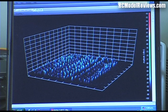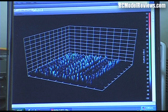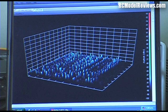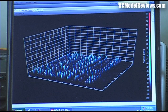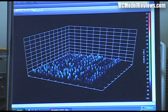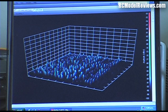I've switched to the three-dimensional view so we can see what happens over time. At the moment the receiver is turned off and the transmitter is further away, which is why the peaks are much smaller. Now I'm going to turn on the receiver - if it's broadcasting anything back in the way of telemetry we should see a change to this pattern. The receiver is now on. I actually don't see any marked change. Even though the receiver is sitting right next to the spectrum analyzer, it should be sending back some information but I can't see any sign of it. The transmissions are either incredibly short - too short for the spectrum analyzer to pick up - or incredibly low powered and being swamped by the transmitter signal.